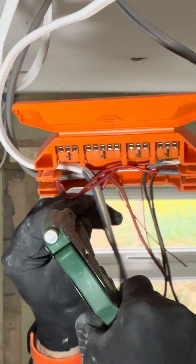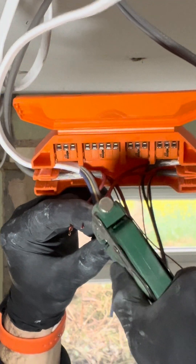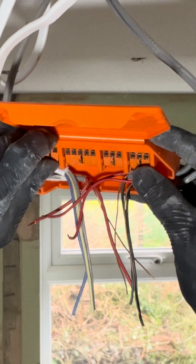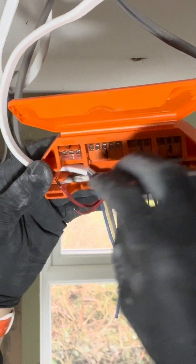And then one switch live that will throw it down to the switch. So open this up — this is your loop. I'm going to put the switch live in the first, so there we go, that one in there. So that is your lives. Let's get that to sweep around a bit neater. That started at the beginning with your permanent lives basically going into there.